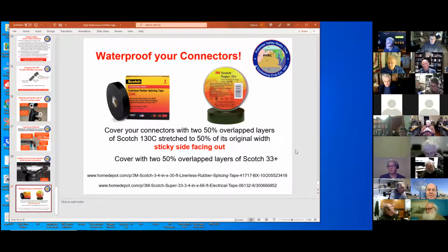Smaller antennas work very, very well. And I think a better choice if you want to build an antenna for sporadic E DXing is a longer boom Yagi, and maybe 2 of those stacked one above the other like JA1BK did in that photograph I showed, rather than going through all of the tremendous amount of effort to build and maintain a 4 Yagi array. Did I answer all your questions?